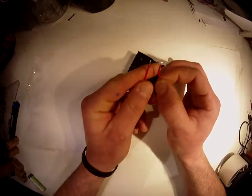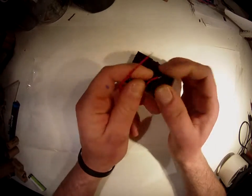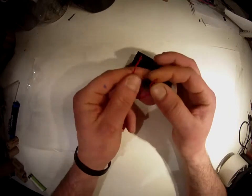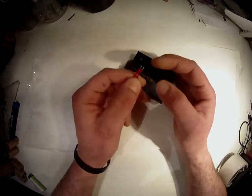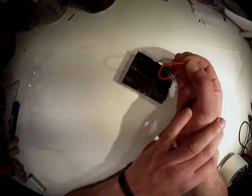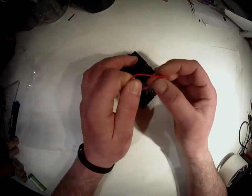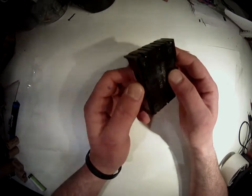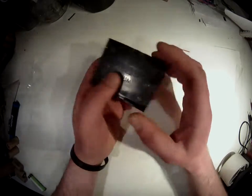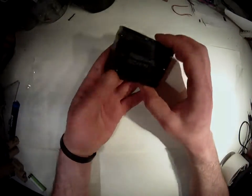These here that usually come with battery packs like these, I feel that they are way too thin when you're playing around with it, because you really don't know what kind of power you want to draw. So I would recommend at least 0.85 square millimeters if you're powering something like a netbook or anything larger than a cell phone, basically. If you're using it for a power tool or whatever, you really should get a lot thicker wires, like maybe 2.5 square millimeters.